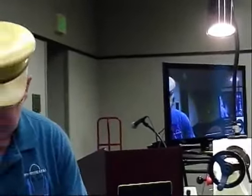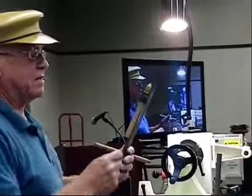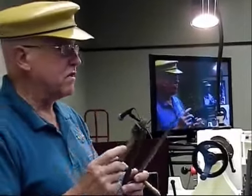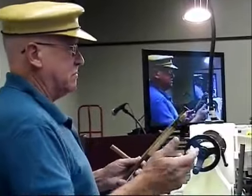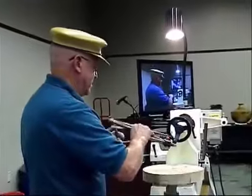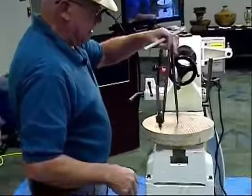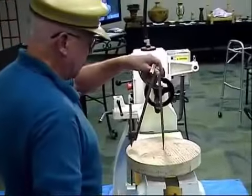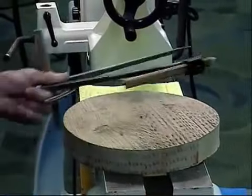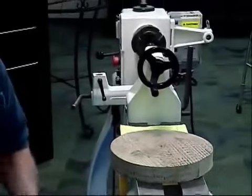And I like this. This is great. I had one of the guys in the club, the winter worker, convert it over to a carpenter's pencil. When you're working on rough wood, the lead just breaks out of those. This is great. Made a slide here, so it's really friction efficient. There are several things here that I've come up with for the stool project, but you ought to have one of these. It plays a couple of roles, makes it round, and then we got to separate the circles. We got to find out how to put 3 legs on a round circle. So this helps out there.